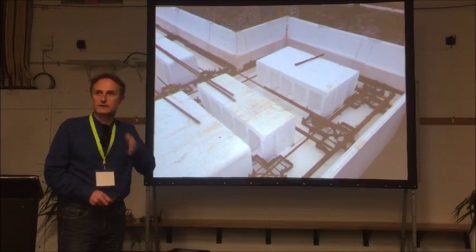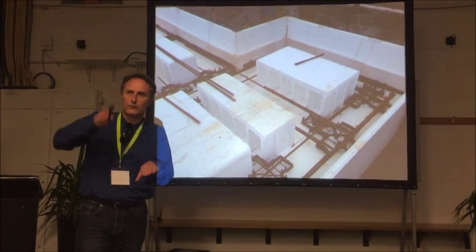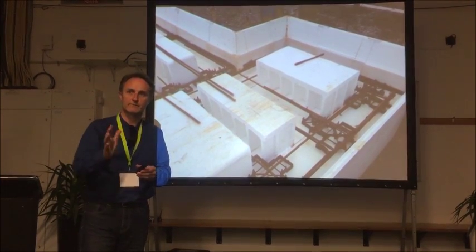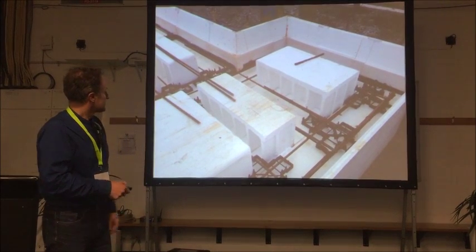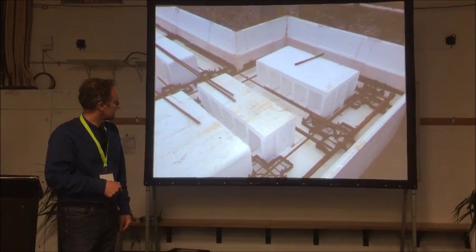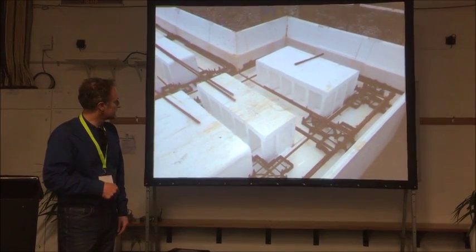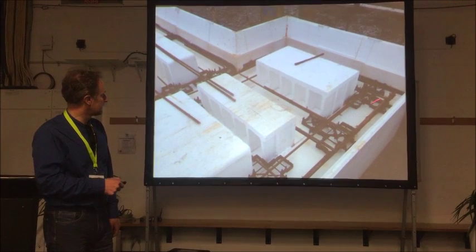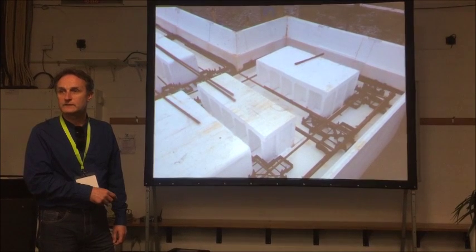Max Raft is a fully integrated system. They have foam forms that are pre-plastered and pre-finished, and it just goes together like Lego. This one here we used the Magrock one, and we took it a step further — we insulated it under the pods. This is a fairly typical foundation in Christchurch now after the earthquakes, because we've got dodgy soft ground in a lot of places.